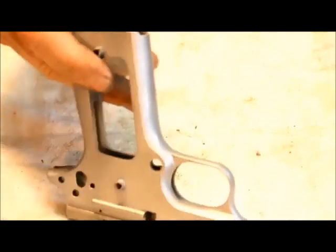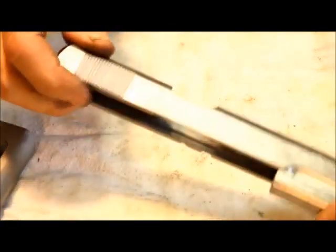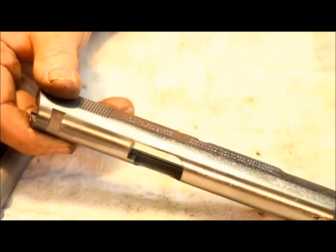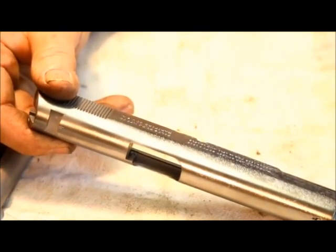And we do a lot of blue jobs like that. Guys could possibly do it on this gun. If you do this matte blue on them, I might matte blue it. Matte bluing tends to camouflage pitting. It'll make it not as noticeable. I mean, you're going to see it. It's there, and you can't hide it. So I'll have to think about it, but we'll see towards the end what I do.